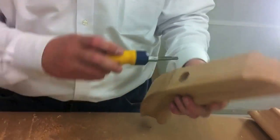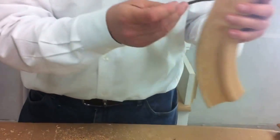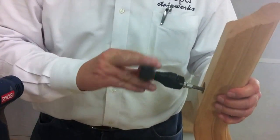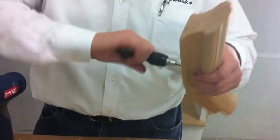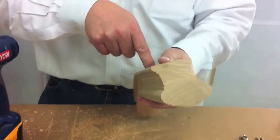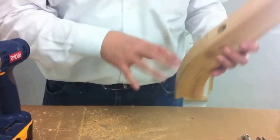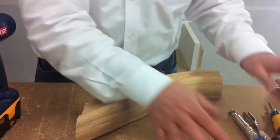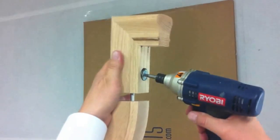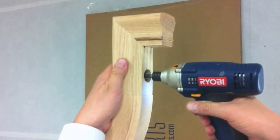There are many ways to tighten it up. Here I'm showing you a small ratchet handle. I bought a T-handle at the local hardware store. For a tight fit on a gooseneck, you might want to use a five millimeter Allen wrench, or a little ratchet T-handle for tight fitting. That's what I like about the zip bolt — not only is it easy to use, I think it's much easier than a regular rail bolt. You have so many ways you can tighten it using off-the-shelf tools, no special tools at all. The head just fits right on top of the end and you put it under power and tighten it down.